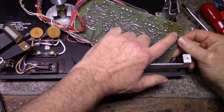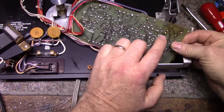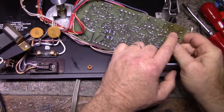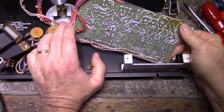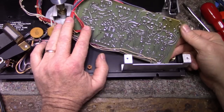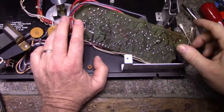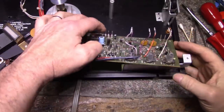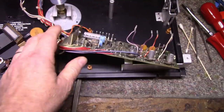You see we're getting a lot of heat here, and that's from the 33 lamp. That's the one that's used the most commonly. Everything looks good. Probably what I'm going to do is re-solder some of these connections. I want to replace these two caps just out of why not. So let's turn on my iron and get that heated up and we'll get that replaced.